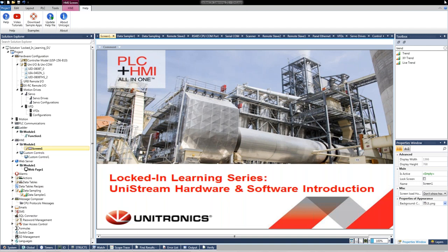Can we change the PLC IP address without downloading? You can change the IP address through info mode: hold the upper right hand corner, go to the network tab, and then change the IP address there.